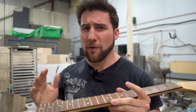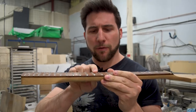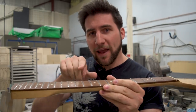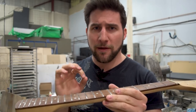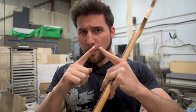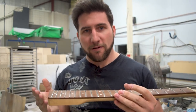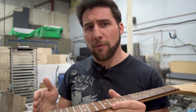Just briefly - Dan explained all of this really well in his video - but the idea is that in order to fret a guitar you have to make contact with your finger right behind the fret, so that the string makes contact on the top of the fret. You want a sharper corner there so the string is contacting in one specific place so that your guitar intonates properly. A well-crowned fret isn't sharp - it's an arc, and right at the top we have that apex of the arc where the string makes contact.